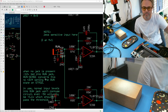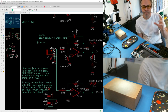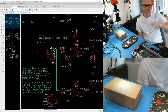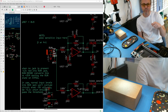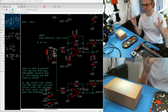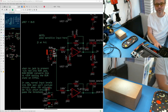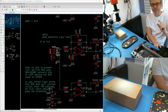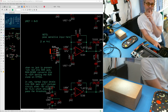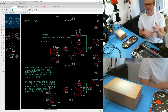Back in 2016 when I designed this, my thinking was I could use that voltage to know that nothing was connected to the jack. When the voltage was within possible ±10 volts I would know it was a real signal. We use this to do what are called the run modes in Just Friends — which you probably already know about. Turns out this is a dangerous technique.